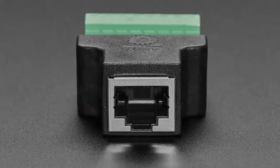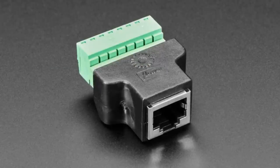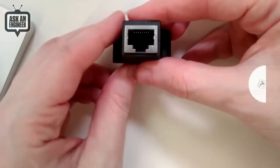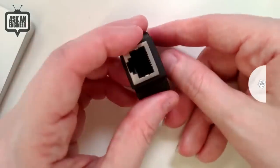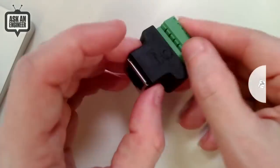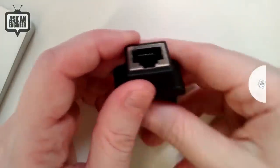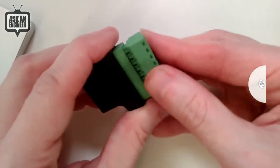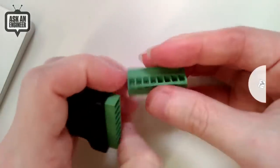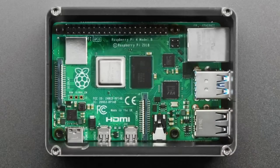Next up, to go with your PoE hat, here is a terminal block to Ethernet jack. We have these with the opposite connectivity — the plug type — and some people want the jack type instead. It's actually RJ45, not strictly Ethernet; you can use it for anything. I wouldn't recommend it for straight Ethernet because the wires come out, but if you want to use Cat5 or Cat6 cable for sensors, I²C cables over long runs, or analog signals, this works great. It has a pluggable terminal block that seats in nicely but unplugs easily. We also have these in the plug version — this is the socket RJ45.